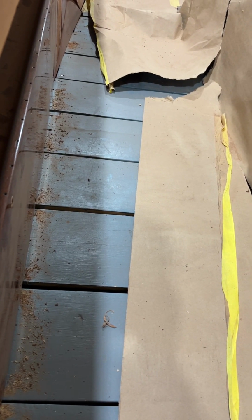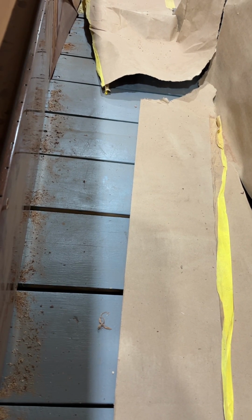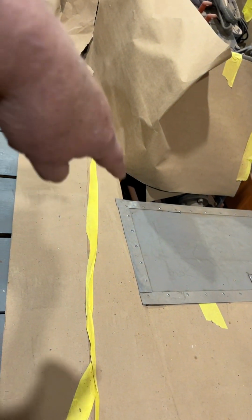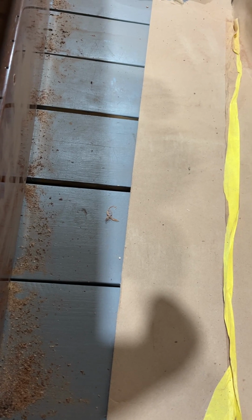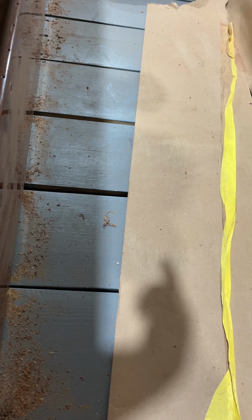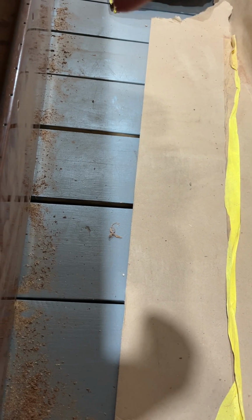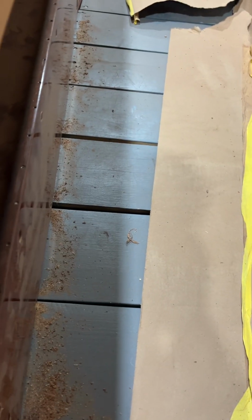Put that down on a piece of plywood, and then lay the plywood down and fasten it, for example, under the engine hatch where the fasteners would be hidden, and fasten it down close to the edge where we can put some trim down and cover that as well. And maybe we wouldn't even have to fasten down the outside edge, but if we decided to, we could. And we may just put a 1/4 round mahogany down there to hold it in place.